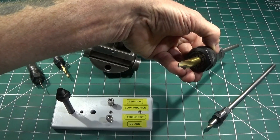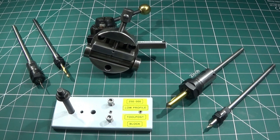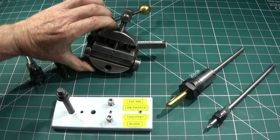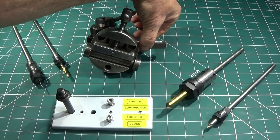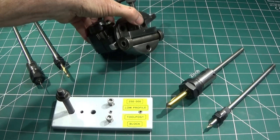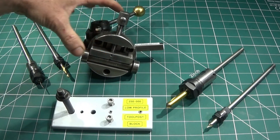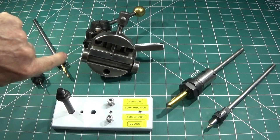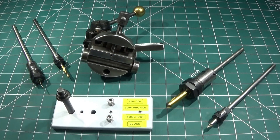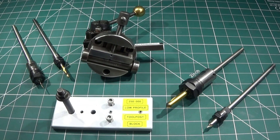In this demonstration I'm going to be using the ER20 collet chuck to hold this spot drill. The only other thing that you need is one of these round vices - you can get them on eBay, I think RDG do them - and a piece of square bar here which is 12 millimetre and fits into the tool holders on the Matchfit tool post. This one simply holds the housing and is secured to the bar with two Allen screws, but you take out one of the Allen screws at the back so that you can tilt the vice. Now I'll go over to the lathe and show you the setup.